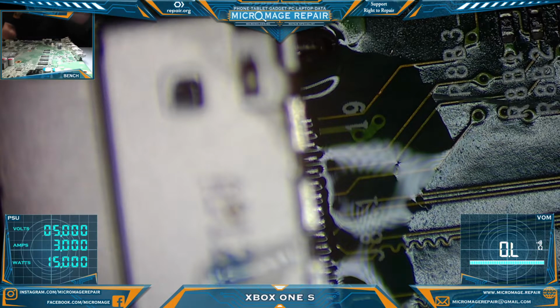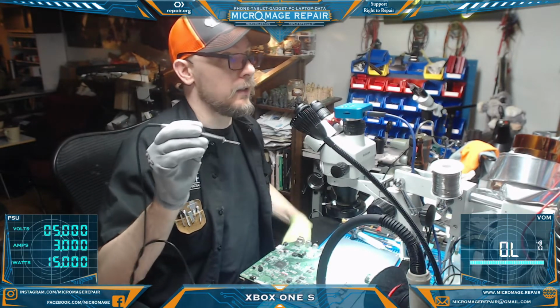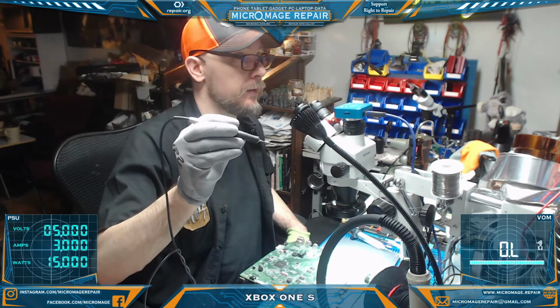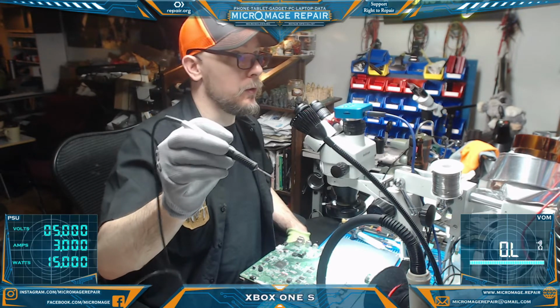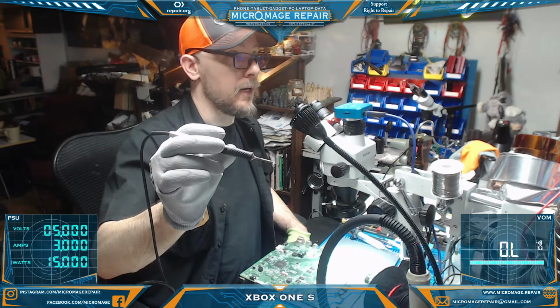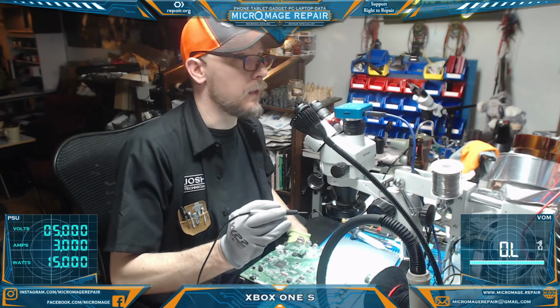Let me show you something real quick. Now, I don't know if you noticed in the scene on the top left, but I've been applying Justin Ashford's method for holding his tweezers and getting more steadiness. Well, I've been applying it to holding my iron as well, putting it through the middle finger and the forefinger, and using my middle finger, forefinger, and thumb to hold the iron more steady.